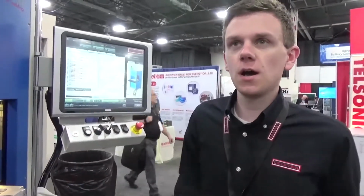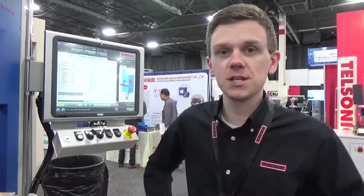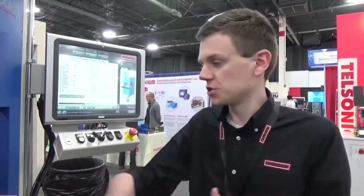This can be used in situations, for example, when you want collapse of the materials, as that collapse can be closely monitored, and then when the collapse reaches a certain value, the welding can be stopped. Another advantage of this method is that you can go extremely fast, up to 10 meters per second, and that enables you to do multiple cycles in rapid succession. That's why it's called quasi-simultaneous welding, because it's almost as though the entire weld region is being welded at once.